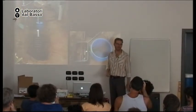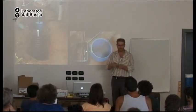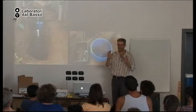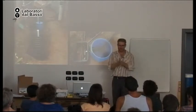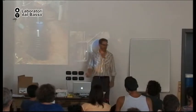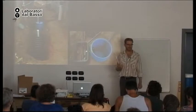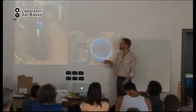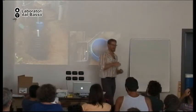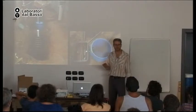But the homeowner here wanted to connect the shower water with the kitchen sink water because both pipes in the house were very close. But that did the horrible thing of mixing kitchen sink black water with shower gray water. So now all the water needs to be treated like kitchen sink water, and so we had to use way more plastic. In my opinion, it would have been much better to keep the shower water and kitchen sink water separate. And then we only would have needed 1, maybe 2 chambers, that's it. And then the shower water could go to a different place. Okay, any questions on that?